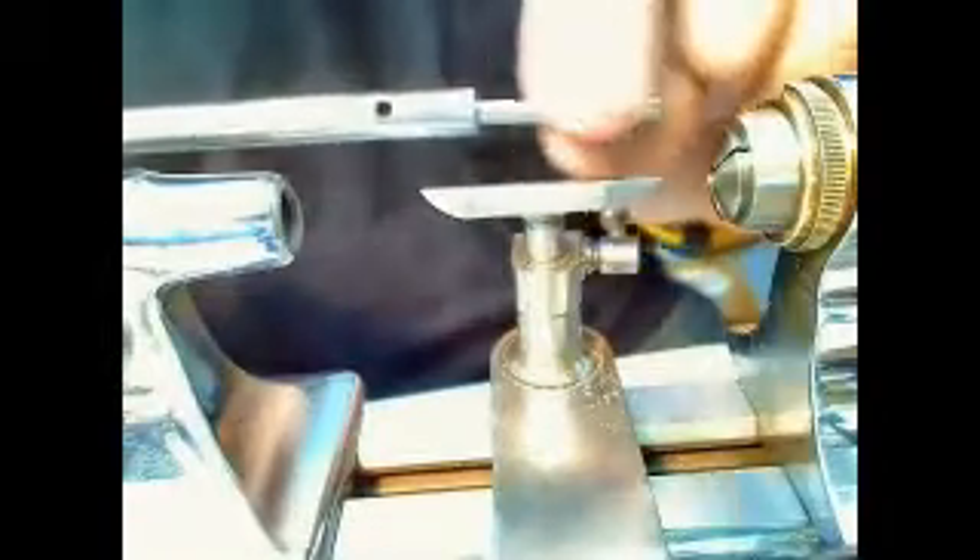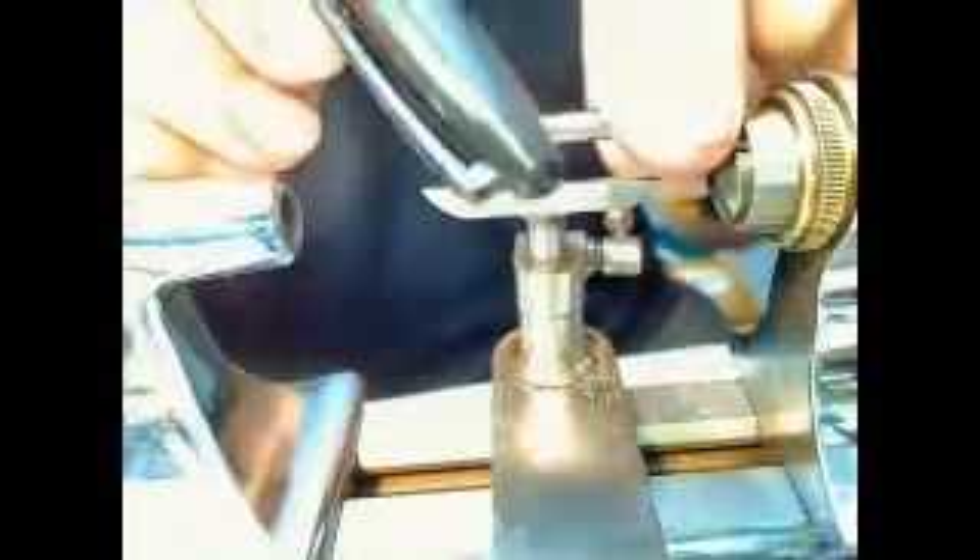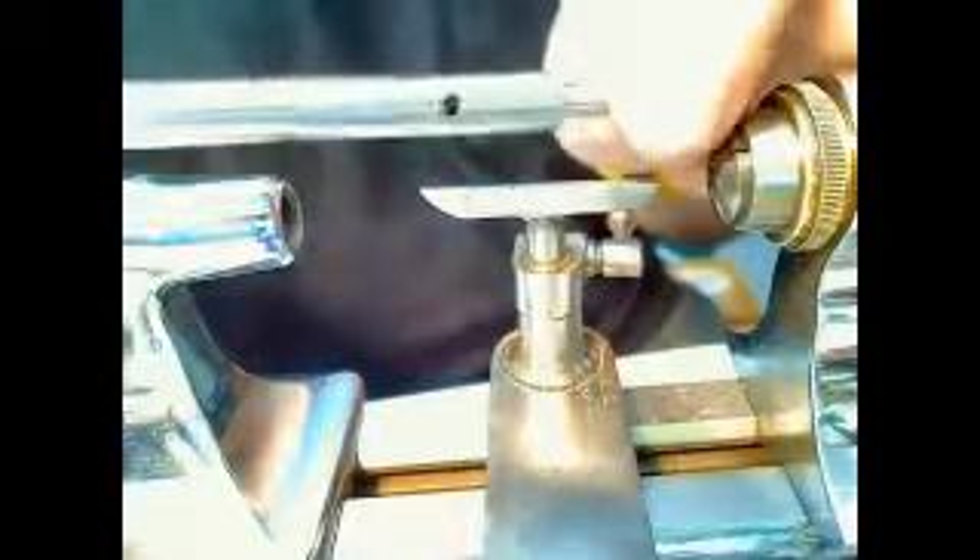This is for knocking the piece out once it's friction fit in. So what you do is you taper it in slowly, and as you're tapering it — basically graving it down with your carbide gravers — you use a Sharpie and you blacken it. Then as you're graving it down, once you've blackened it, you stick this in, rotate it once, pull it straight out, and you can see the marks where the high points are. Then you use your graver again and take out the high points. It takes about an hour to do this.